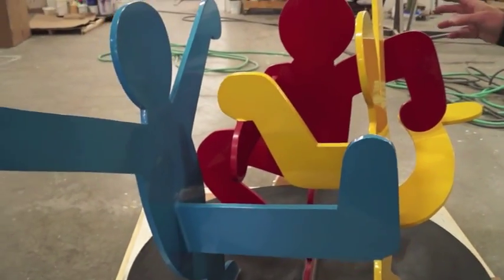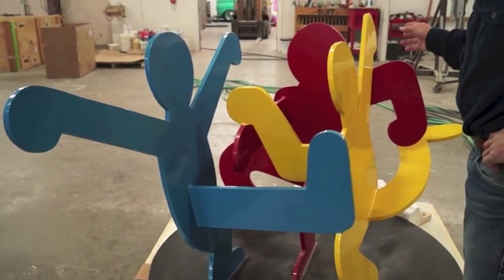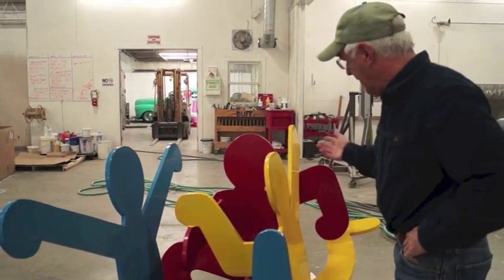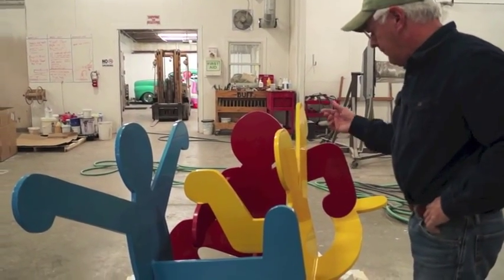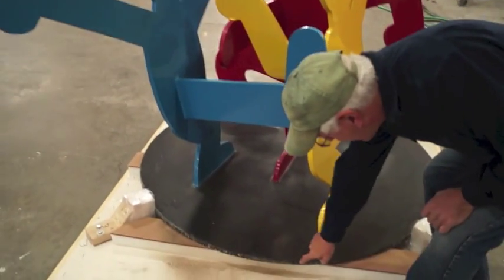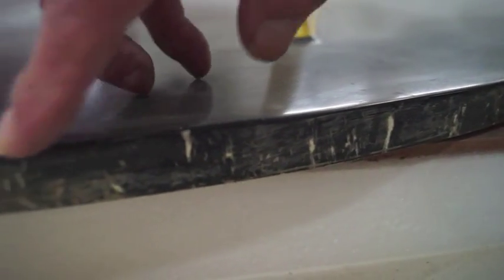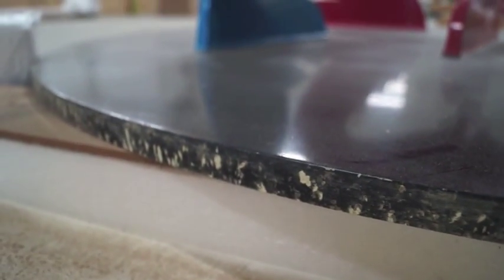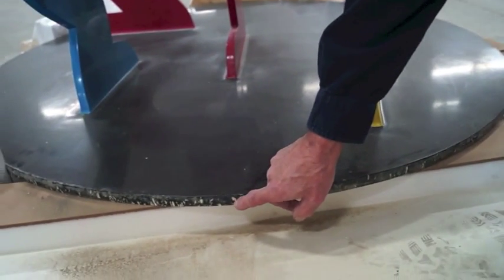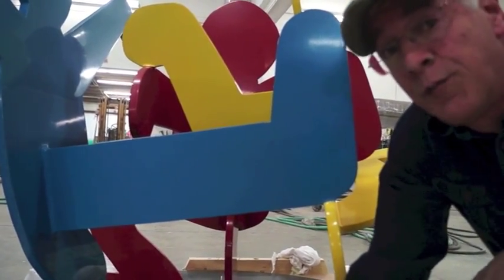Now, when you look at the actual figures up here and the colors, considering that this has been outdoors for 10 or 12 years, hit with sun every day and with sprinkler water, groundwater really, every day, it ended up with very little fading, very little corrosion. The only corrosion that we have is immediately in areas where things have happened, where it has been hit by a lawnmower or weed whacker. There's been some mechanical damage, but every damage shows no progression of corrosion. Yes, there is corrosion in the immediate area where the damage occurred, but it hasn't seeped underneath the paint to cause more paint failure.